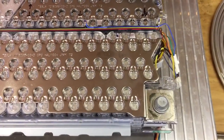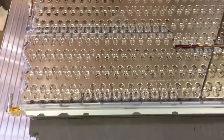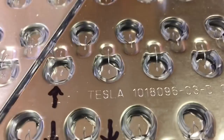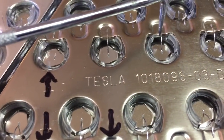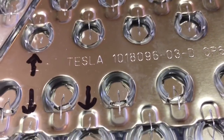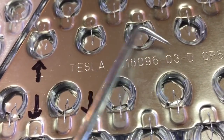I'm going to dismantle this pack and show the nature of the battery modules. They are a 6-series, 72-parallel configuration, so there are 72 of these little microfuses that carry up to 1500 amps, which is pretty amazing because these are pretty delicate little things.